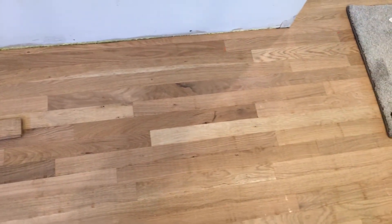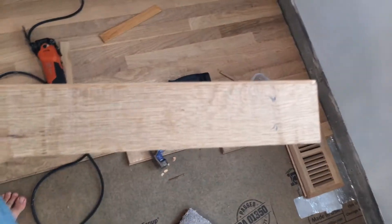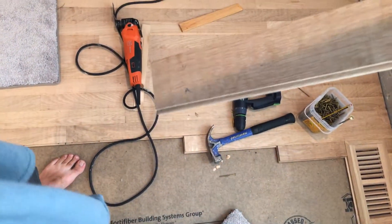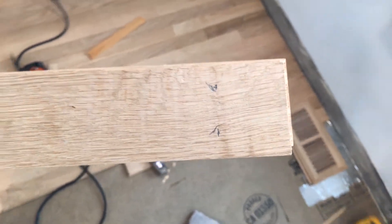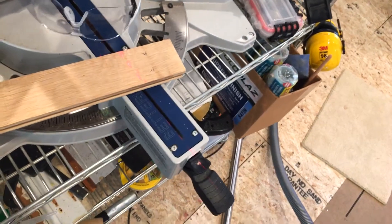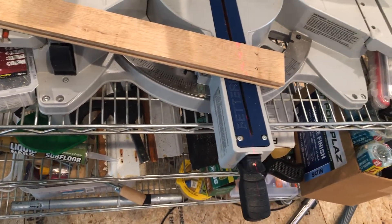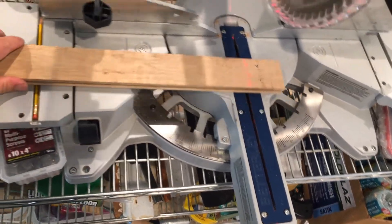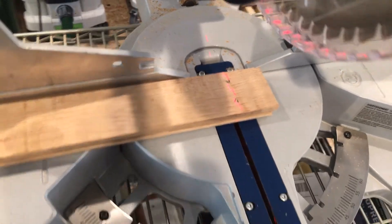The cabinets will come 24 inches off the bottom before the toe kick, so I know the first 24 inches is a free area for lower-quality wood. In this case I need to cut a piece for the end — cut the tongue piece off since it's going to reverse direction. The straight line is where I want to keep the wood; the zig-zag line is where the kerf should be. This piece came from the damage pile with a small knot, but since it's within the 24-inch covered zone it's fine. Personal technique: I always leave my safety glasses on my saw so I remember to put them on — that one time you don't is when you'll get a splinter in your face.